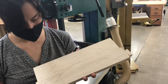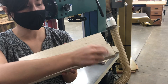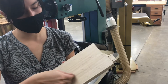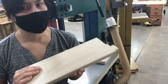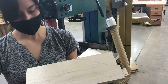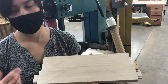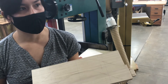My next step in shaping is to take this to the bandsaw and try to cut as closely to my line as possible — probably about a thin sixteenth. In a lot of cases as I change direction on the bandsaw, I might be creating areas where the blade could get bound up. So I'm going to make a series of relief cuts that act as escape routes in case the blade starts to bind and I can't navigate through the cut.